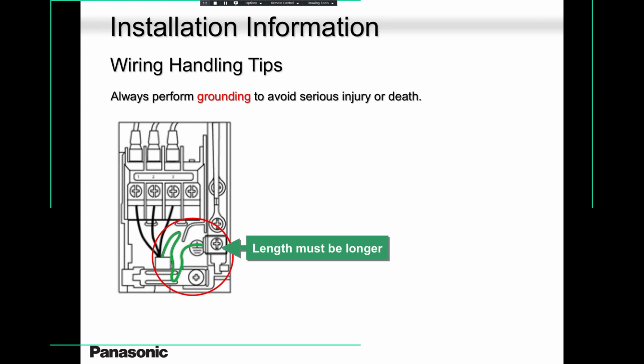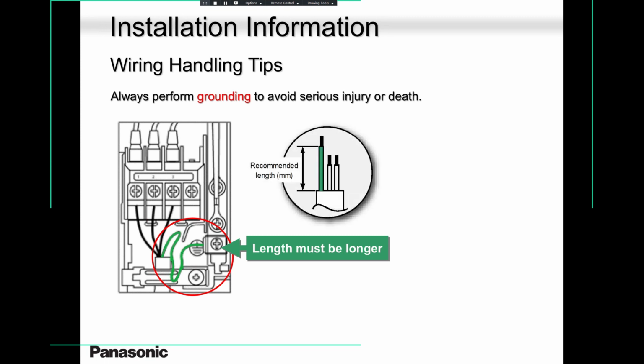Wiring. This is the wire that I was talking to you about. 1, 2, 3, and ground. This wire runs between indoor and outdoor. Never join this wire, please. Never. If you have no choice and there is a problem, say there is a condensate pump calling for some cutoff, you can cut number one, but never cut number two and number three. You will always have nuisance calls. And nuisance calls means really, really nuisance. Another word for that is very stubborn, because you can't find the problem.